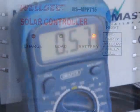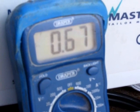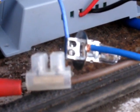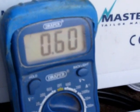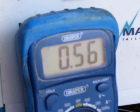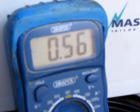Now the problem is the battery's in float mode at the moment, so without running the battery down I'm going to do a crude test — just put a 70 watt bulb across the output and put the meter in series with it to see how much current we're actually getting. I'm using a 70 watt 24 volt truck bulb as a load. We're getting about 0.6 of an amp at 28 volts — roughly 15 watts. But that's power that otherwise I wouldn't have had.